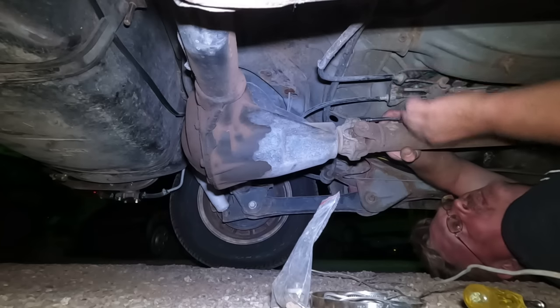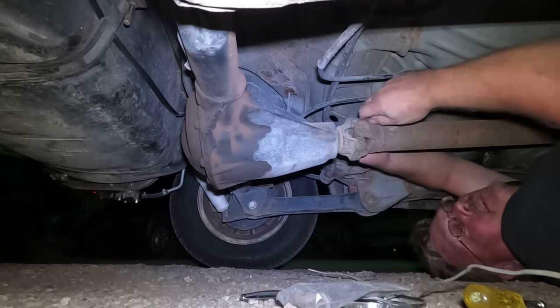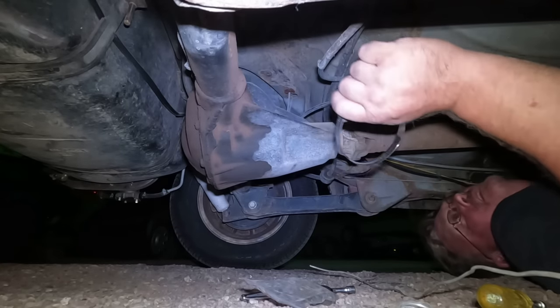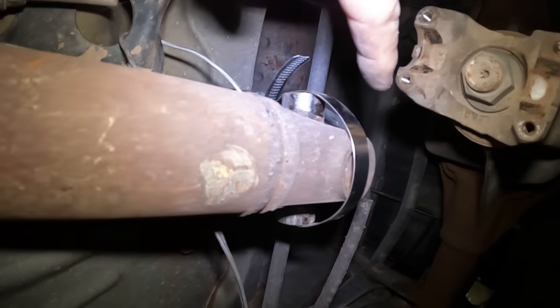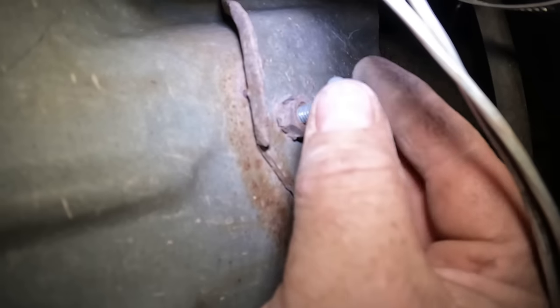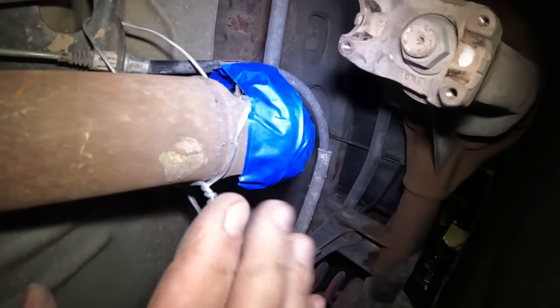So it's around 1am. I just thought it would be a good idea to remove the driveshaft — I don't know if that transmission actually oils just by spinning or needs the engine running, and I don't want to destroy the transmission on the drive. So I'm going to pop off this driveshaft so that only the rear end spins. I've got a hose clamp to put around the U-joint caps to make sure everything stays together. I'm trying to tie this driveshaft off to the side because I'm worried the rear end is going to move up and down. I found a nut plate with a few threads in it — I'm just going to thread a bolt in from the back side.